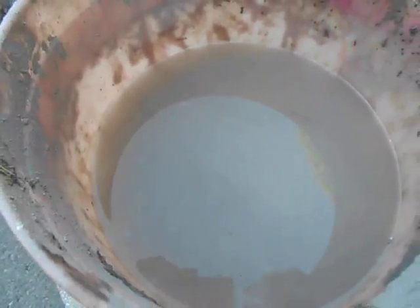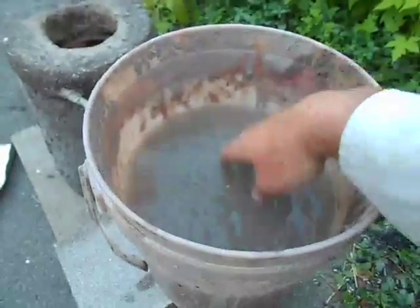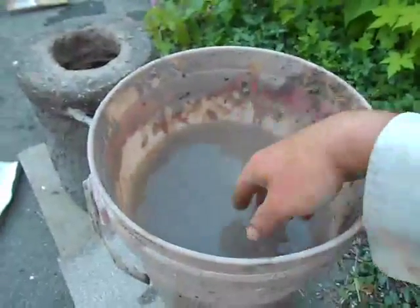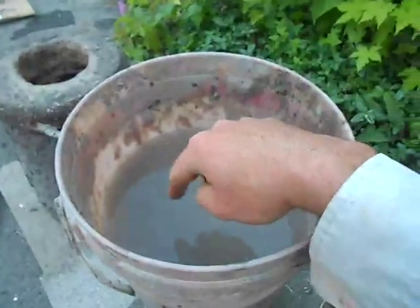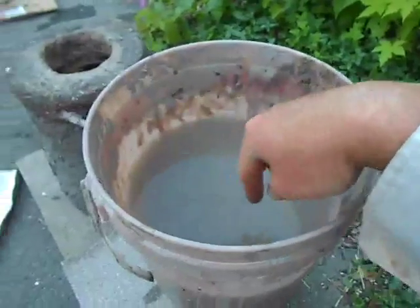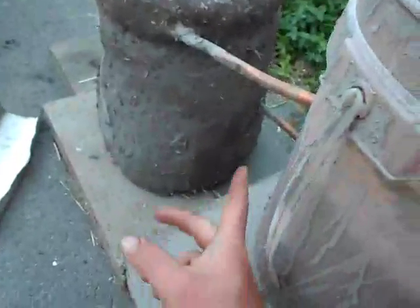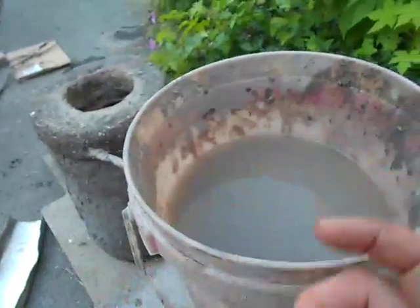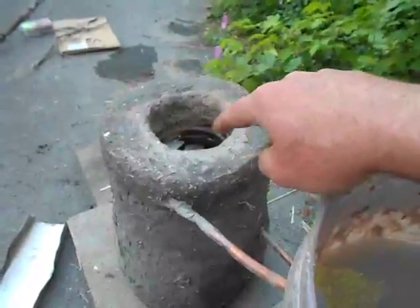You can see it — it's steam shooting off the top. It's actually really hot, not too far off from being boiling water already. It's been running for about 10 to 15 minutes, and this is a really inefficient system right now, but it's just an experiment. This is clay-y water — it's nice that it's clay-y because I can see the murkiness and see that jet. It's all just thermosiphoning, completely passive. There's no pump — the cold water enters the bottom, gets heated in the chimney, and is pushed up as it expands back into the container. More cold water comes in, and so on. Just by the nature of running the fire — you can see the copper in there.